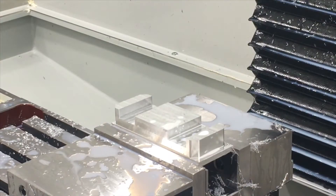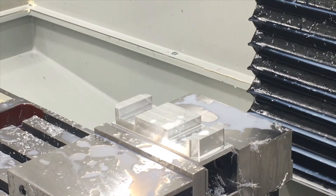Now we're going to drill the holes and tap them. The tap is going to go down 0.375 inches. The drill point is 60 thou high, so I'm going to add that, and then give myself an overall 20 thou of clearance between the flat - imagine the drill point cut off, 20 thou from that to the bottom of my single point thread mill. Let's roll.